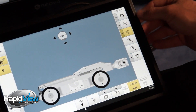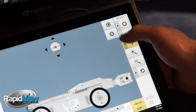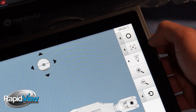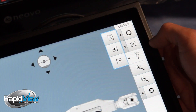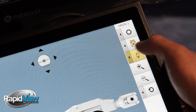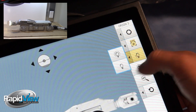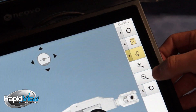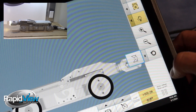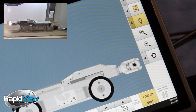On the right here we have our camera functions. We have the Orion 3 hooked up. Plus and minus allows us to open the shutter to allow light in and out, and then clicking the button manually adjusts it. Plus and minus for the autofocus, and then we can turn it off and on. We have lighting — plus and minus to add and take away light, then off and on. And then zoom — plus and minus. And then this is the 360 pan and tilt function. This is the e-flip, which allows us to flip the video image at the 180 degree mark.